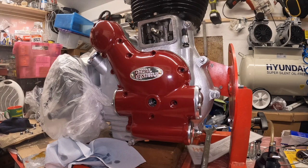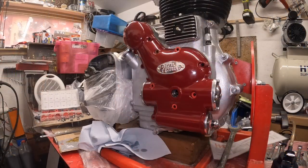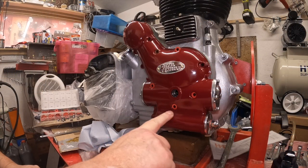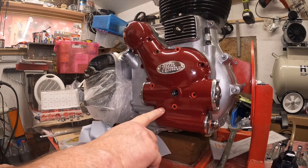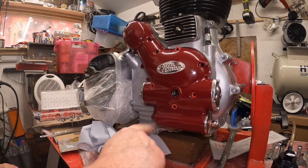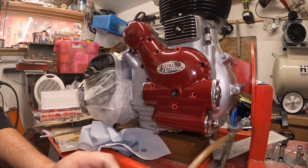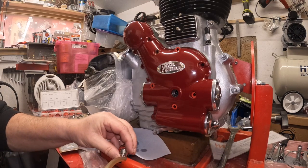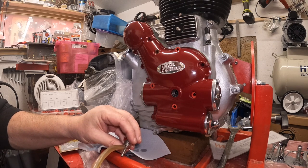According to this, the parts section, the parts book is brilliant. I mean, you can go by that. Right, so typically I haven't got the right size washers, copper washers rather. I've got the right size fibre ones, so I'm going to have to put an order in. I'm not going to put the old ones in. Well, I could. I'd have to anneal them and everything, and then it'd be a pain. And they look awful, the second-hand sort of thing. We don't do second-hand, yeah.